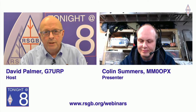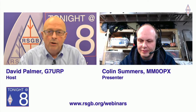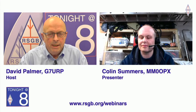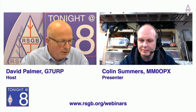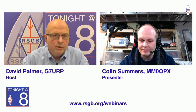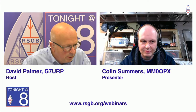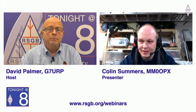One of the difficulties with all this sort of thing is who invented what first. But anyway, acknowledging what you say, Peter, I'm sure that if you were to contact Ian GM3SEK, he'll address it. He comes back on something else as well. He asks, why do you use a 3 kilovolt capacitor? Because he says 500 volts is more than enough in a 50 ohm system.